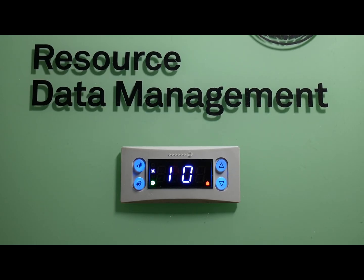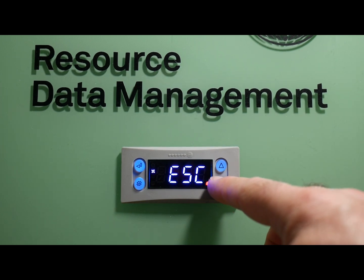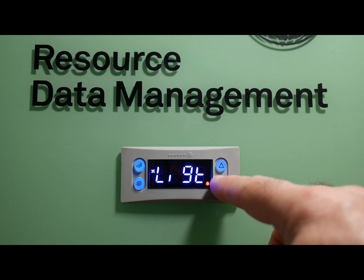In this section, I'll be showing you how to connect a 740 series controller to a DMTouch using DHCP and IDs. There are two ways you can connect the 740 series controller to a network: one is through the DMTouch as a DHCP-enabled device, and the other way is through a static IP address on the network. In most cases, we use a DHCP server on the DMTouch along with an ID in order to bring the case controllers together.